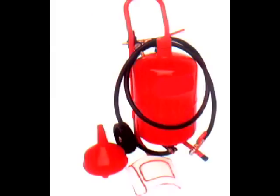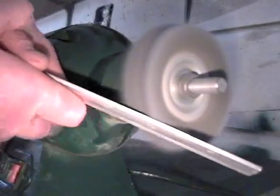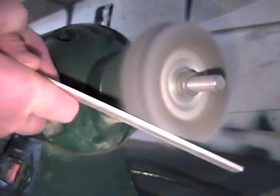Oxide layers are best removed by fine abrasive or bead blasting. Different abrasives will give different finishes, and we suggest you experiment with these. The Caswell scrubber wheel will also work well when sandblasting equipment isn't available. It has the disadvantage of not being able to get into nooks and crannies.